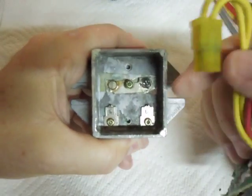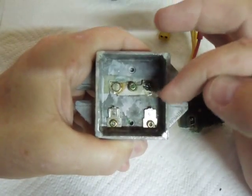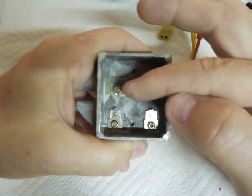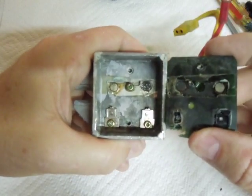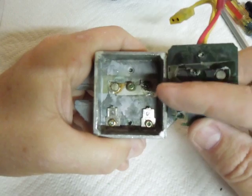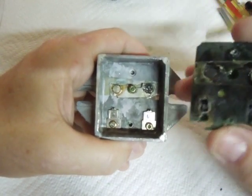The body is definitely a heat sink — you can see where these two components are bolted to it to pull the heat away. This is where I think the issue was: this diode, or whatever that is, is burned up right here. This one that goes together with that one. So anyway, that's why it went bad.